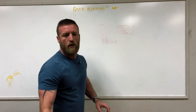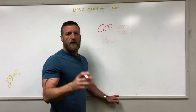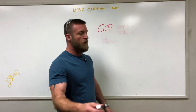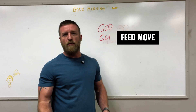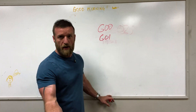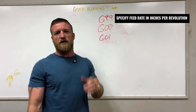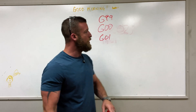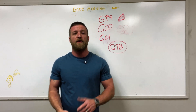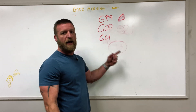There are a few other codes you'll want to know as you begin your journey as a CNC programmer. G00 is rapid — a rapid move to what I call your approach position before you begin to cut. After you rapid in, most likely you're going to do a G01, which is a feed move. Feed is how many thousandths per revolution you're going to move, as long as you're in G99. G99 is a code that specifies your feed rate in inches per revolution, as opposed to G98 which is inches per minute. On a lathe you might use G98 if you're using live tooling or something of that nature.